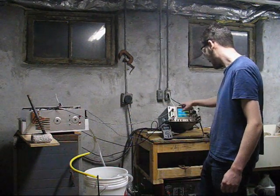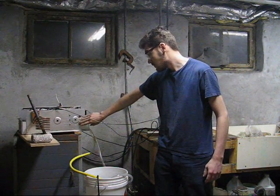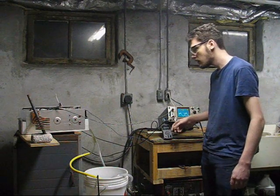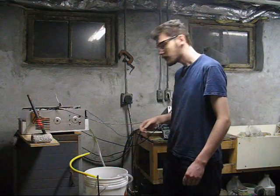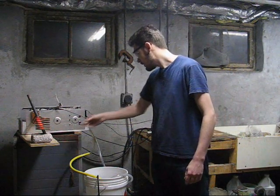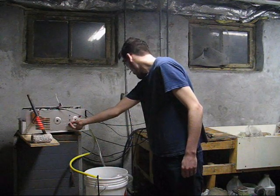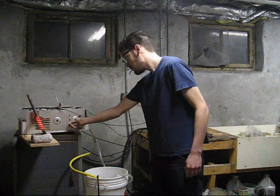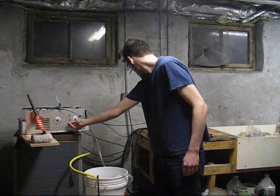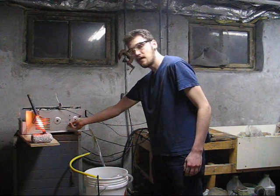It's off right now, no signals yet. Dare I press the button — it's running. We've got 30 amps peak. Kind of whining — it's got that kind of frequency. It's getting hot. We've got pretty close to 320 volts. That's good. Let's see how hot we can get this. It's in current limit right now. Phase is at max — it's got phase a lot. That's 60 amps peak.